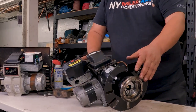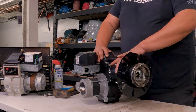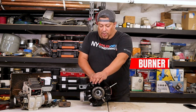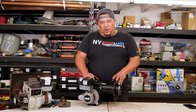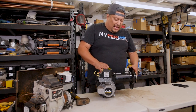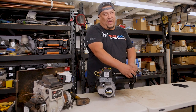This one's an easy one burner, so you guys can know. We're going to identify the parts first. This tube right here, we call this a blast tube. This over here, we call this a burner flange. It's a two-piece — on the burners, it's a two-piece. Sometimes they come in one piece, but most times it's two-piece. That means the blast tube is independent, and you can get a separate flange if the flange goes bad.